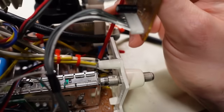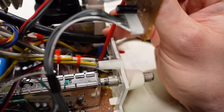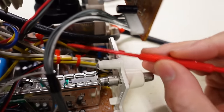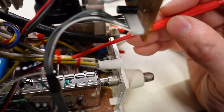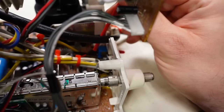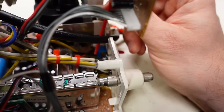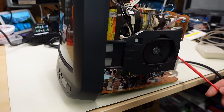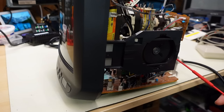There's one more thing I installed — it'll be hard to see since I don't want to take the monitor apart further. There's an adjustable potentiometer hot-glued onto the side of the video input jack, and that's the voltage divider that takes the sync signal coming in through the DB9 connector — on the yellow wire — and allows me to set that sync signal to about 1 volt peak-to-peak, which is what the composite video input is expecting.